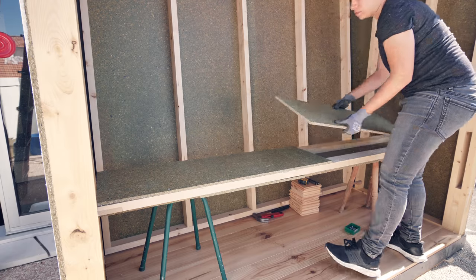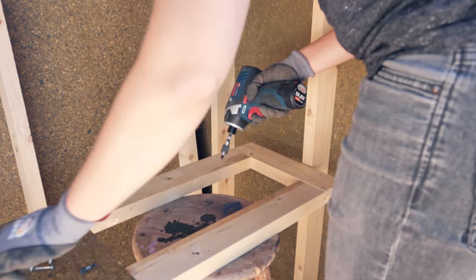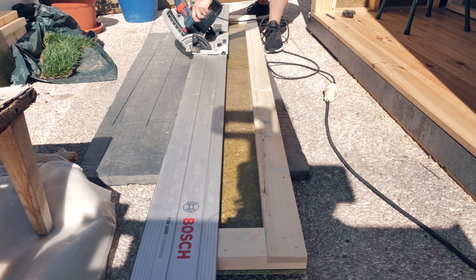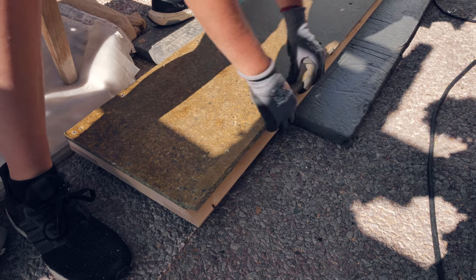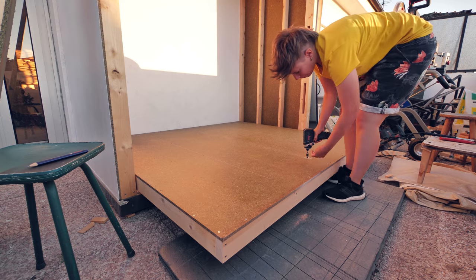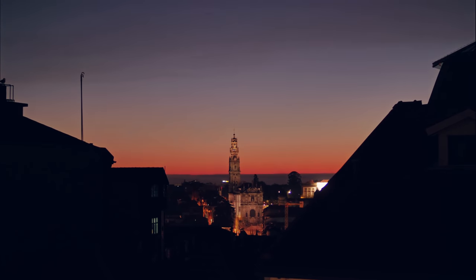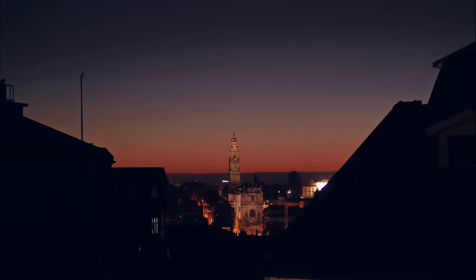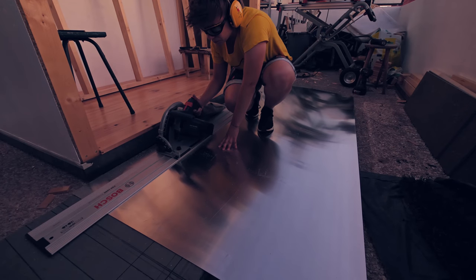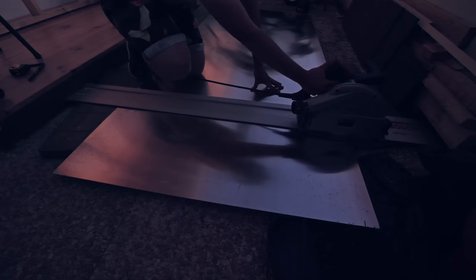Here I was removing the board material to swap it for metal sheet. I also removed the screws that were near the edge that I beveled with the plunge saw set to 45 degrees — this was made to remove the bump for when the bottom piece is opened and sent to ramp mode. The blade couldn't go all the way through so I tore apart the rest of the material. I ran to the hardware store to get some aluminum sheets as the sun was starting to set. I wanted to bring the sheets cut to size but their guillotine wasn't big enough so I had to cut them myself. The plunge saw has a variable speed which is awesome, and I could bring the speed down to cut the metal.